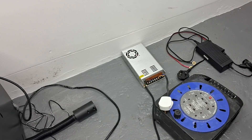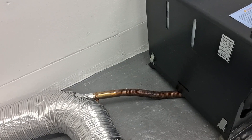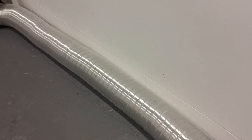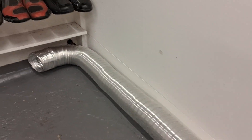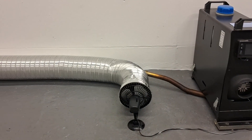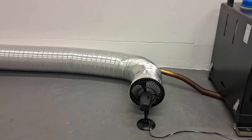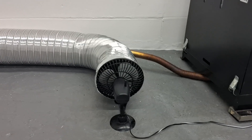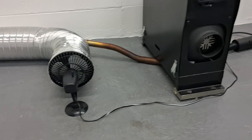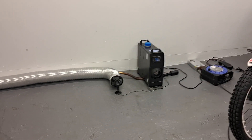I've got the 30 amp power supply which is converting 240 volt mains electricity to 12 volt for the heater. On the 1 inch exhaust pipe which comes out of the heater, I've got a six foot extension tube which goes through this 5 inch ducting to outside. I've passed the 1 inch exhaust pipe through this 5 inch ducting, which is heating the air up inside the ducting, and at this end of the tube I've got a 12 volt fan which blows the air through the ducting over the pipe. The 12 volt car fan is just running off the same power supply which joins up on the back of the heater.